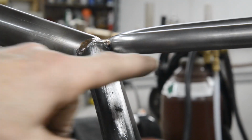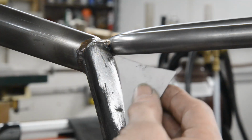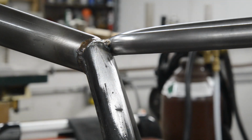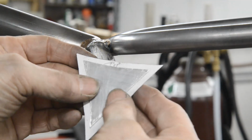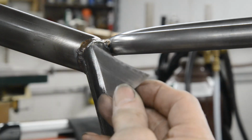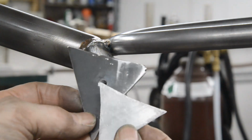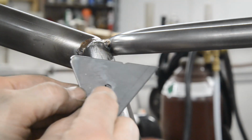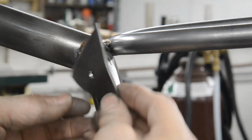So here we're going to fit one right into here. So again, a cardboard template. Then because this was thicker gauge and there's slight curves in it, what I did was I made up another piece 1/4 of an inch smaller, just out of aluminium, so that would act as a guide for the plasma cutter. And then with that I cut out this, drill the hole, because what we're going to do on the back is put a captive nut, and I'm just working on this one now, putting the curve in.